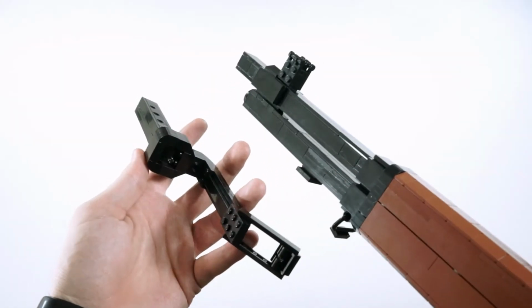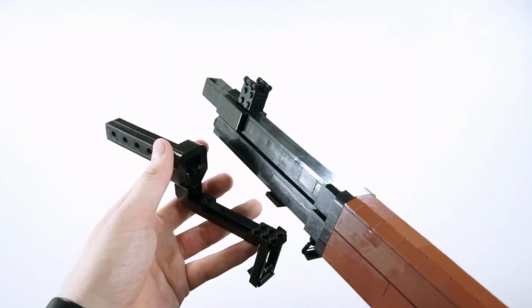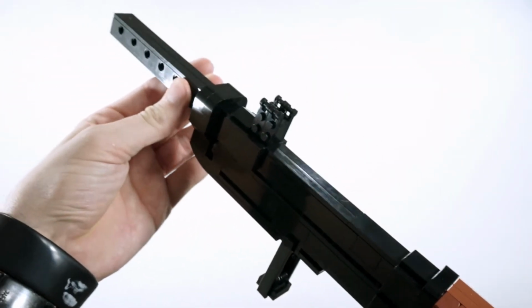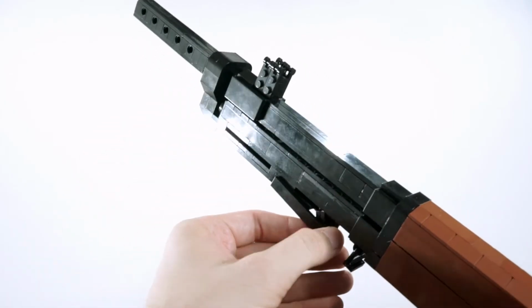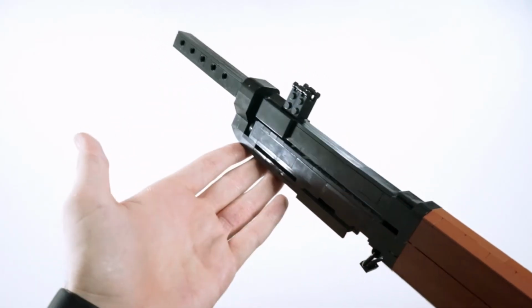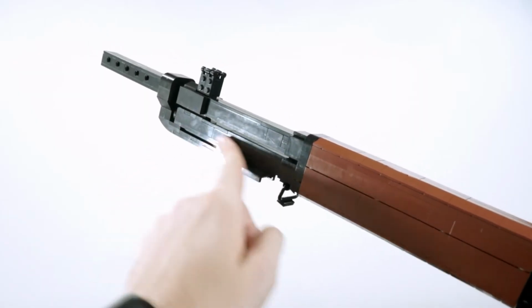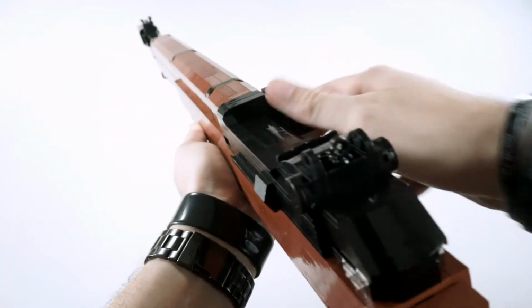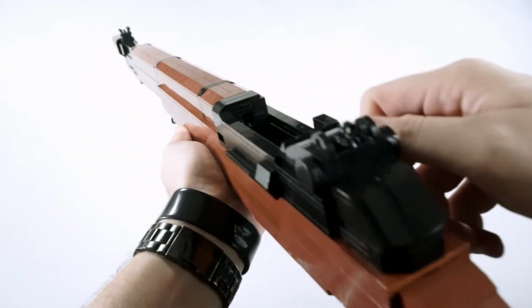On my gun, it's almost similar except that my version actually comes in two different pieces, the barrel and the plunger. But once they're attached, it cuts off access between the barrel and the gas system, allowing any pressure fired from the chamber area to shoot completely through the barrel and nowhere else. Essentially, a really easy way of turning your Garand into a bolt-action rifle.